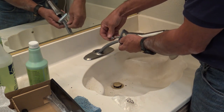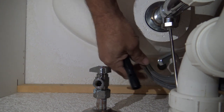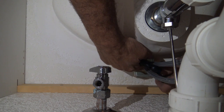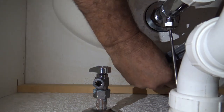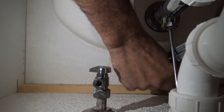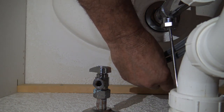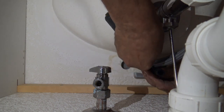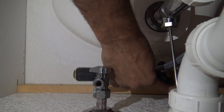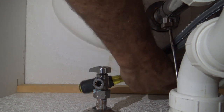We'll do the hardware on it — this will slip up like this on the other side, then we'll put the retaining nut on and screw it tight. We're going to take the bracket and install that, put the retaining nut on. They gave us a handy little tool here to tighten the unit up. Once you get some resistance, crawl back up top and adjust the faucet to make sure everything is straight — then come back down, put a screwdriver in the hole on the adjusting wrench, and tighten it up nice and tight.